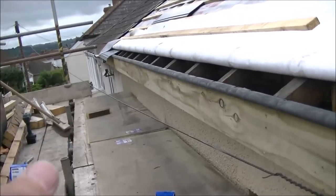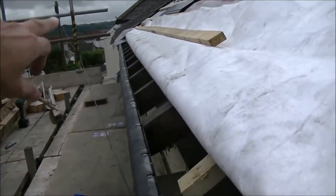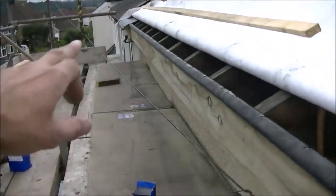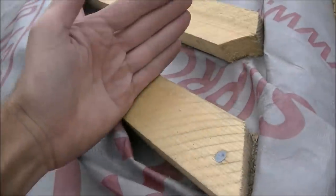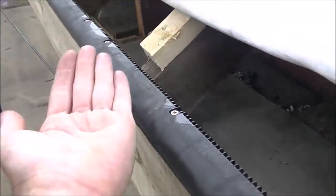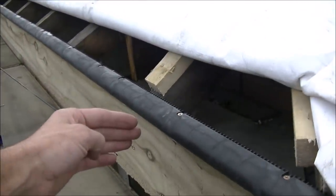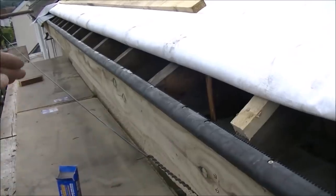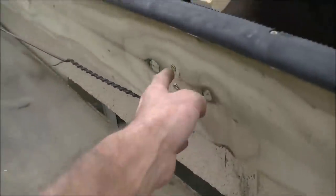What you just saw was: I cut all the rafters down to get a nice straight line, tried to line up with next door from one end and bring it down. Then we put the fascia board on by putting a piece of fascia vent on the top and doing a straight line off my battens using a straight edge. You butt your fascia board up to that with the vent on it — that's the level you want. We screwed that end in, did the same for the other end, put a few screws in the middle, and once level I worked my way along screwing all the fascia board in. I used two screws into each rafter off the fascia board — just gold screws.